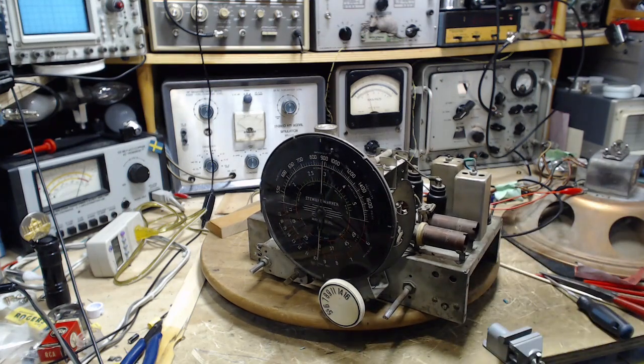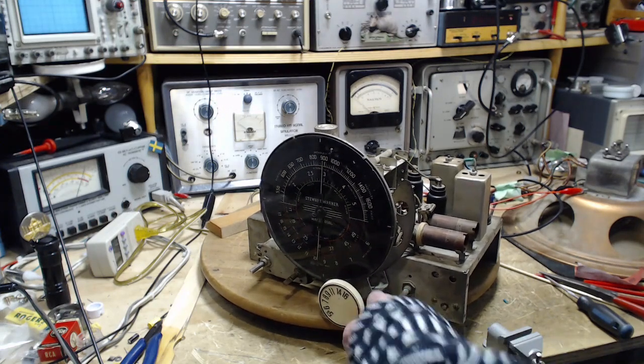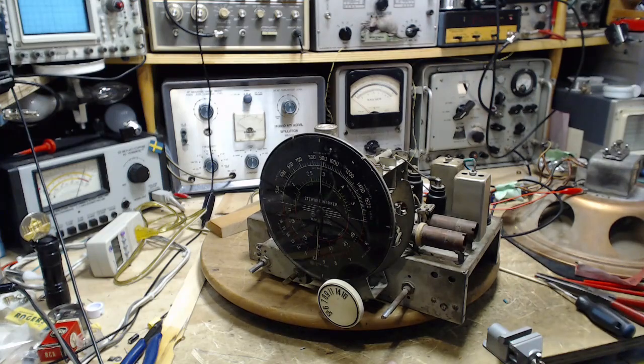Now, does that have special stuff? Turn the range switch to the extreme counterclockwise position. Be sure D and G terminals on the antenna strip are connected together. And they are connected together. Feeding into the antenna still. On here to another section. Just looking at my document.